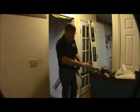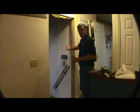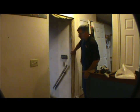That would actually snap the head off. And if you notice, I did a zigzag pattern. One thing about decking boards is they like to warp, so I like to do a W pattern on down, so that way you're completely flush and it'll remain flush forever. So, very simple on that.